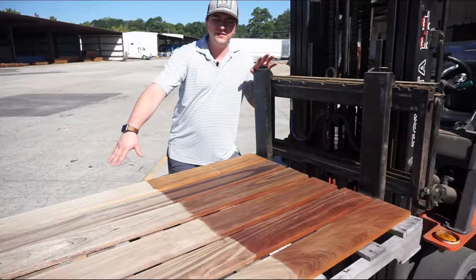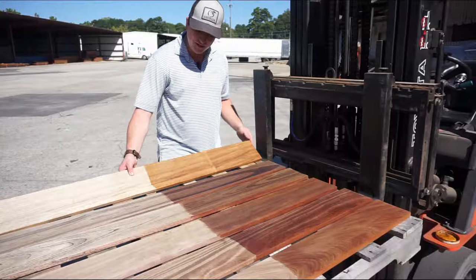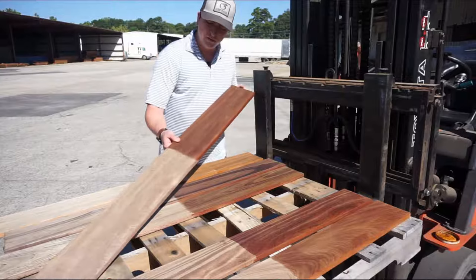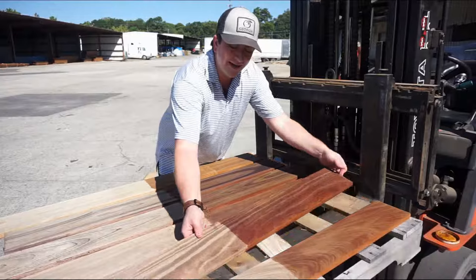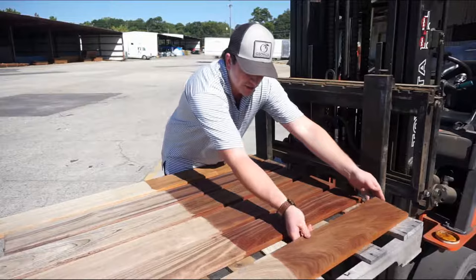I've re-oiled all six boards on half of each board. The other half I'm leaving in the sun to continue to gray out. As you can see, we've brought back some of the color for the Garapa. This isn't a stain or a sealer — it's a UV oil that protects from sunlight, so it's not meant to change the color dramatically; it just helps saturate the wood a little bit. Look how it brought out the grain back in the Tigerwood — there's more contrast on the oiled side. Same thing with all of them — Purple Heart, Kumaru — you can see it brought back some of the grain pattern and contrast.